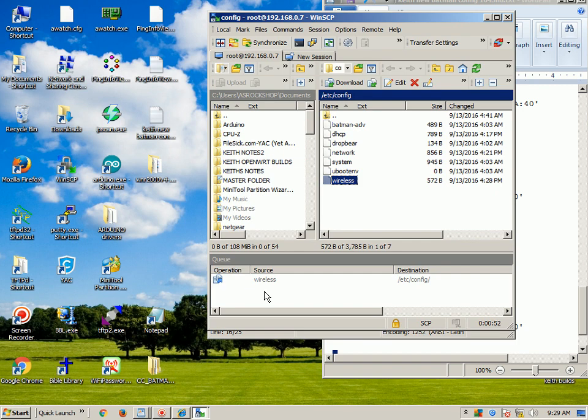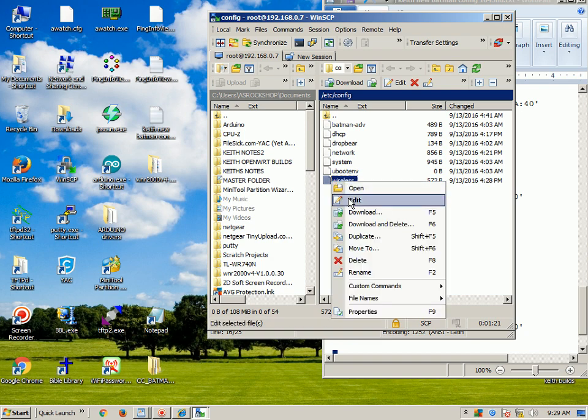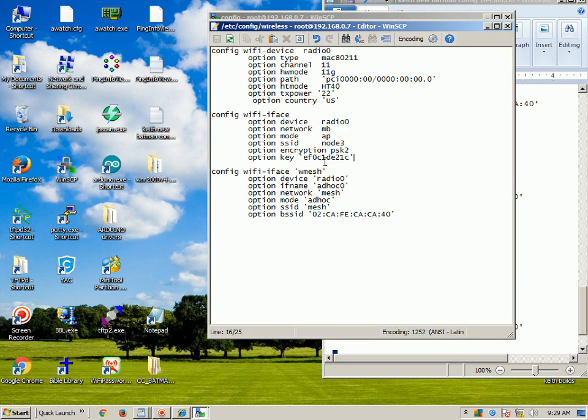If you don't want nobody to log in on the node, you can have all these different security keys, but they need to be hexadecimal. Me, since I'm up here in the mountains, all 3 nodes or any more nodes I make, I'm going to keep them all the same, just for the ease of logging on to the ones I need to log on to. If I go running around and I want to log on that node, I ain't got to remember a whole bunch of stuff. Okay, let me double check it. Right there it is, encryption, PSK2. All right.